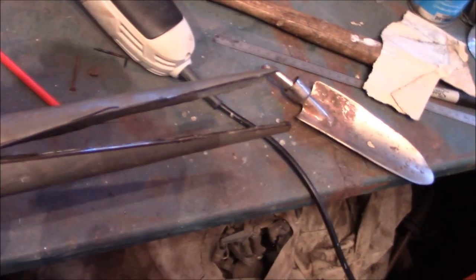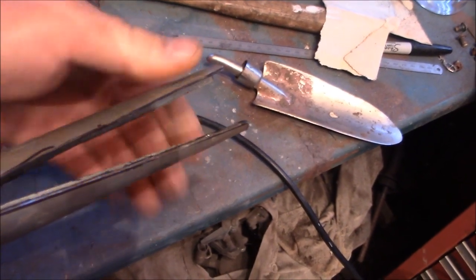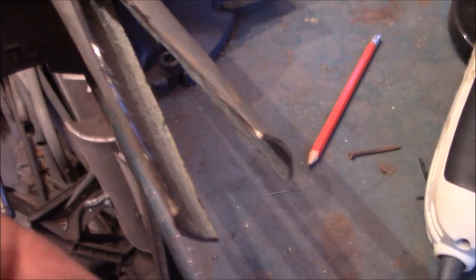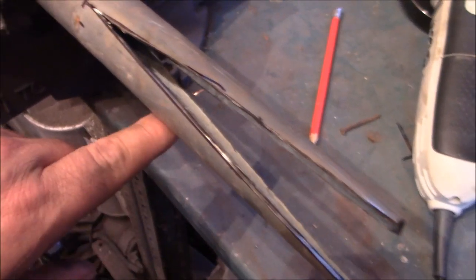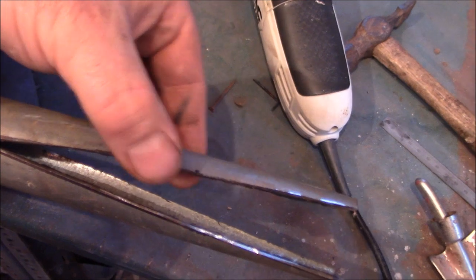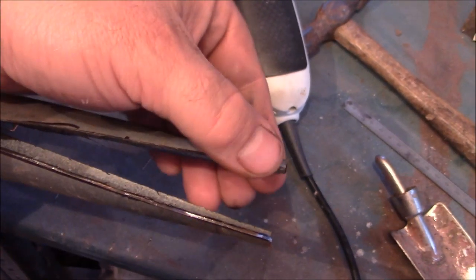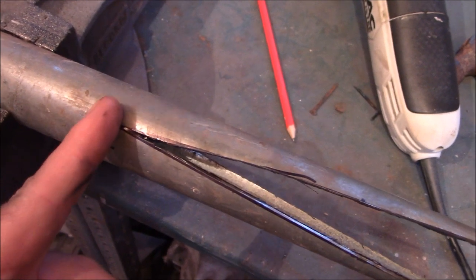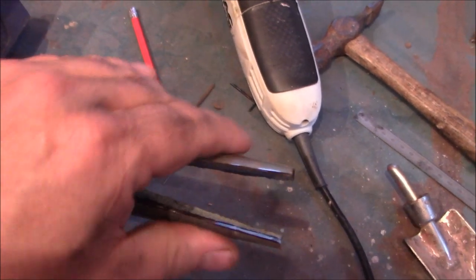There are the two slices cut out. I'll form these round and bring the two pieces together. You can see I've cut a slice out from the top and an identical slice from the bottom, so I'll end up with two pieces to weld together. These two edges will weld together and the bottom will weld together, which will basically give me a cone shape. All I need to do now is cut these two pieces off, then I'll have two pieces I can form round to make the handle.